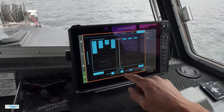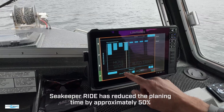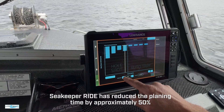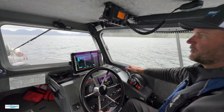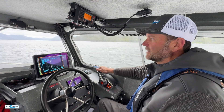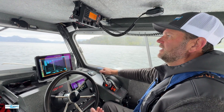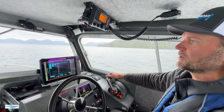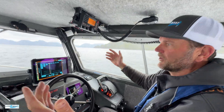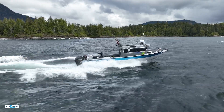Earlier we were playing with our hole shot and top speed — we actually got it down to about 5.2 seconds zero to 30 playing with this lower end trim. I think this is going to be a great curve when we're loaded with customers, fish, and ice. As you can see, we just popped right up on step — it's forcing the stern up, getting the bow down, and we just planed out immediately.